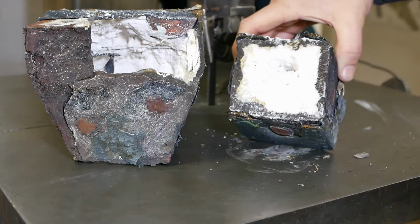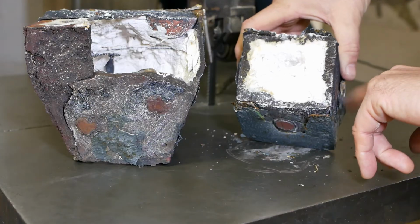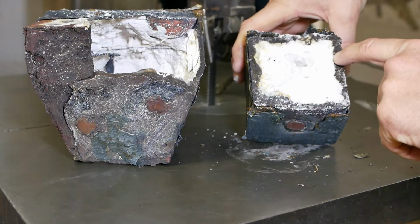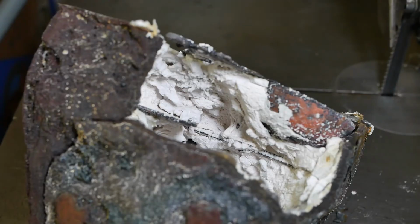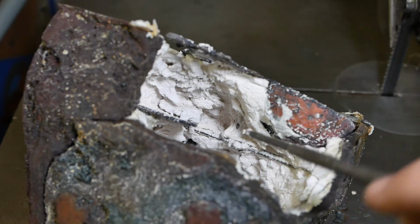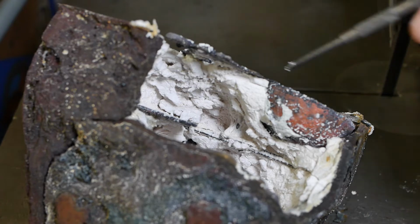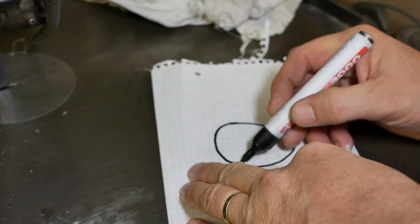I'd appreciate feedback from people who have done block casting before on what they think of the idea of leaving a mild steel flask on over the top and having it diffuse in. When I set the mould upright, just before pouring, the thing which I saw, which worried me, here's the pouring basin here, and when I look down the ingate, which must be, I guess, down in here, it looked sort of like this.